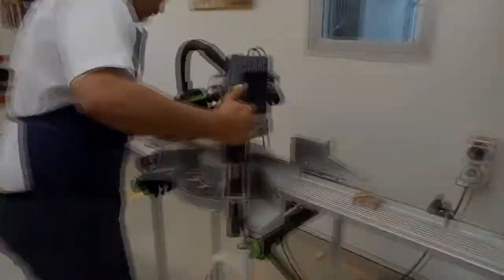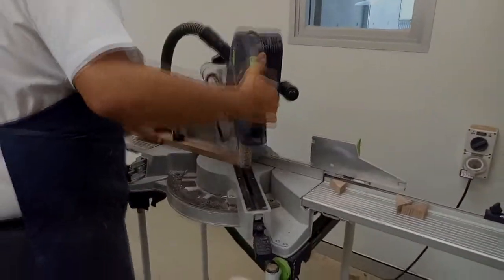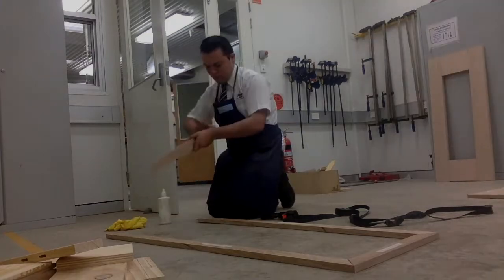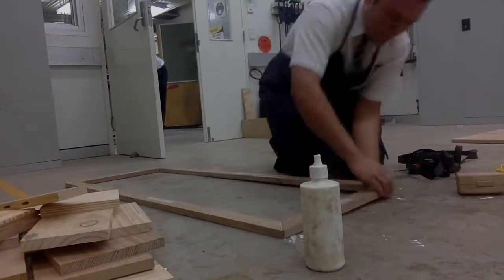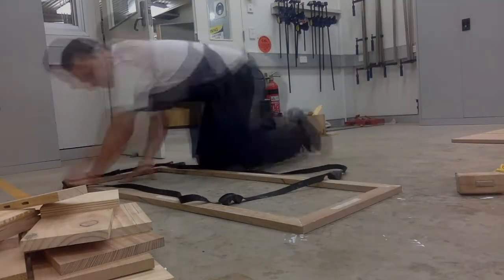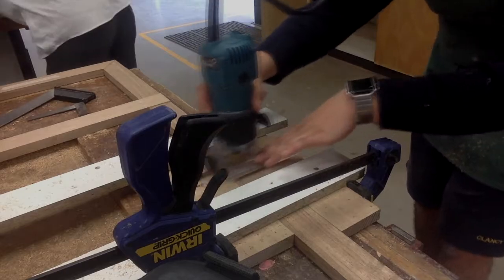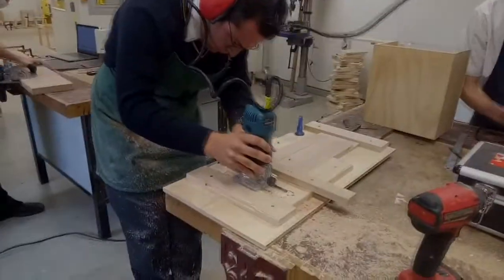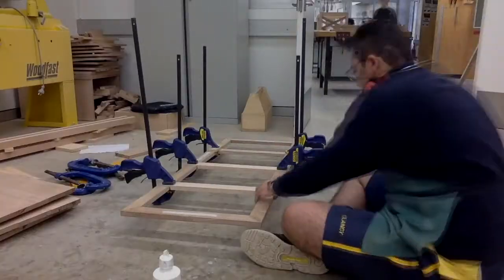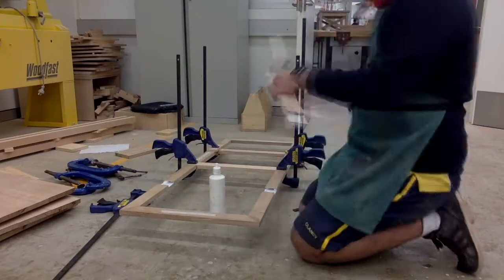Following this, we prepared for the process of creating our frames. This was done by setting up the drop saw at a 45 degree angle and dominoing these angles. They were then glued using 6mm thick dominoes, webbing clamps and PVA glue. Jigs were then created in order for the router to create our cross halving joints for the frames. The cross halving joints were glued with PVA and quick grips.